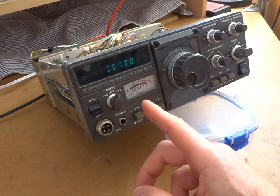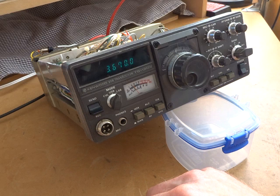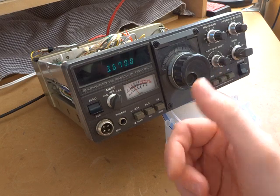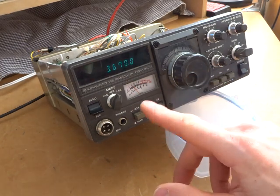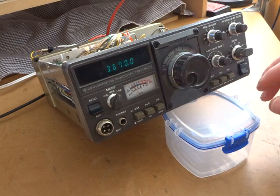So what I'm picking up on the monitor radio, the other radio that is, must be the low power exciter, either coming straight out of that balanced modulator and any buffer circuits after that. I'd have to check the circuit diagram, or maybe a low power stage before going into the high power stage. But suffice to say, there's obviously an issue there on the high power side.